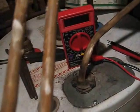Now this is the heating element under a magnifying glass. You can see the crack in there, the break. There's a couple of them. I've seen heating elements worse than this that worked without any problems. This one here just happened to corrode all the way through. You hear the water rushing out now that the element is out and the air's getting into the tank.